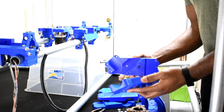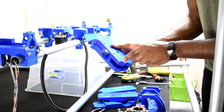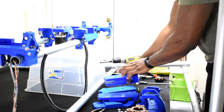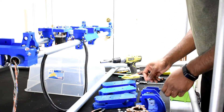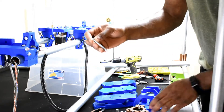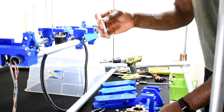Once you finish printing these, grab a quarter-inch drill bit and drill these three holes down here. Once you have four of these assemblies — you can see I have four of them on the table now — you will also need the belt pulleys; you need to print four total. For each of these assemblies, you will need ten quarter-inch by three-inch long screws.